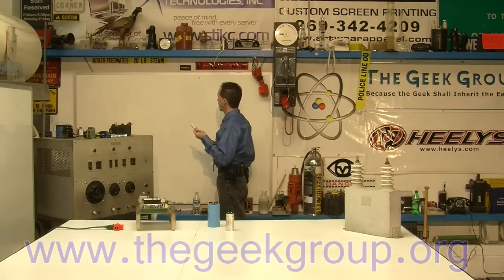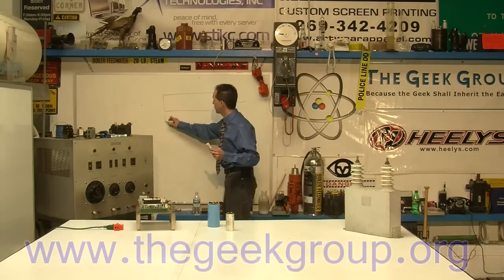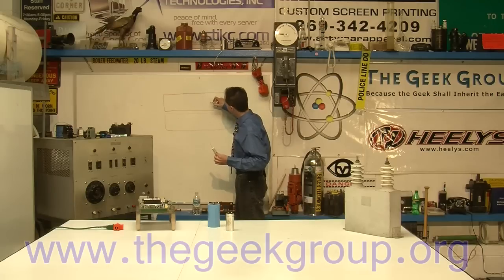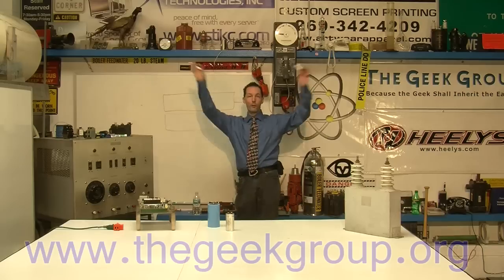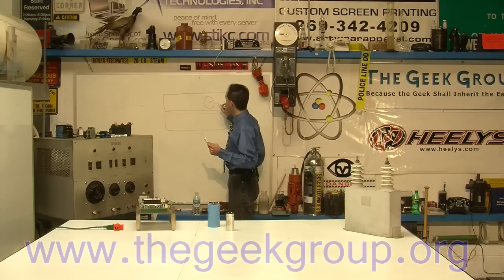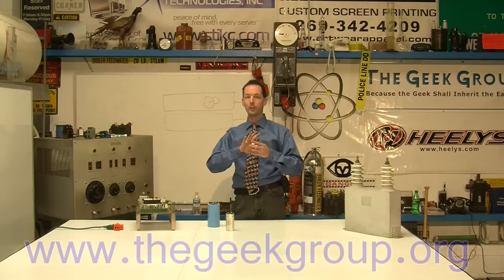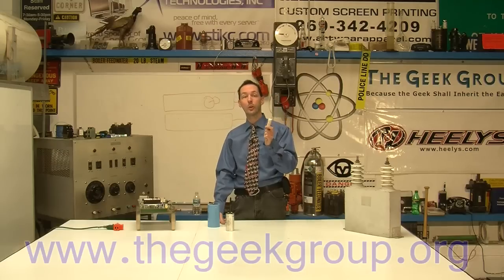However, these are made internally with foil. The electrical connection goes off here, and then there's another piece of foil, and they put them together and roll them up like a burrito — those are the plates of the capacitor. The foil inside, if it arcs from one plate to the other by overvoltage — because in between them is a thin sheet of plastic — when it hits it makes a really big hole; it vaporizes it, just poof, it's gone. It creates a hole bigger than what the spark can travel across to arc again. We've taken these apart after years of abuse and internally they look like Swiss cheese — just holes everywhere — and they still work and are still within spec.